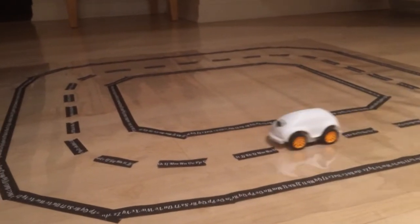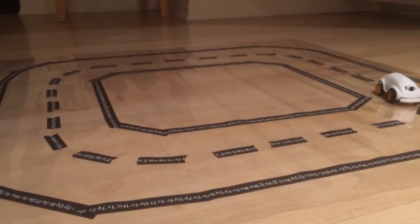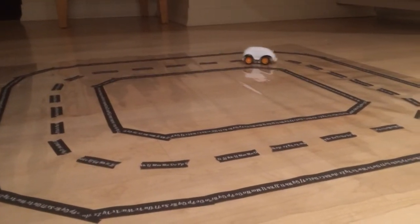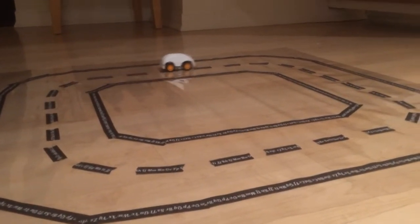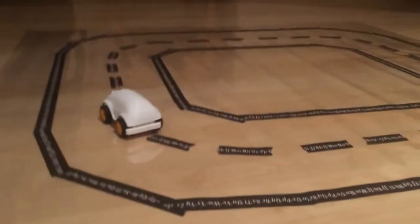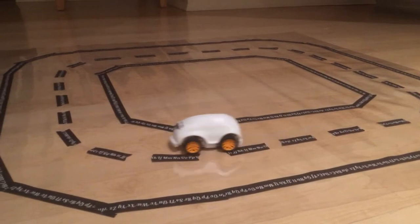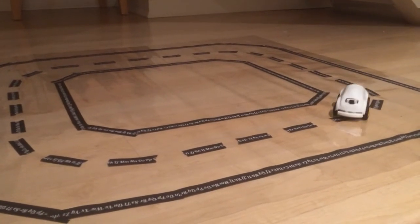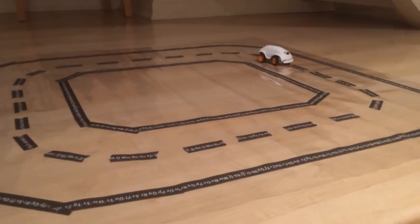This is vision only, using the camera that's on there. It's using the same hierarchy, the same neural network design that NVIDIA came up with, with just a few differences because it's using a smaller image — a 64 by 64 image. It's running that at about 17 frames a second for control, using a fairly deep CNN model running okay on the single-core Pi Zero.